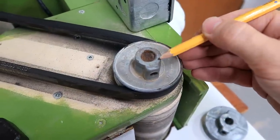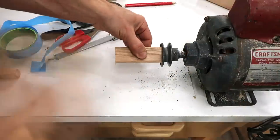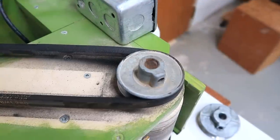Whereas in my workshop, if a pulley starts rattling I notice and I fix it. The pulley in my table saw has started to rattle from time to time, and the pulley in my 20-inch bandsaw also rattled at some point — I just shimmed it. I found that if I take one of these pulleys and put a plastic shim in so tight I have to hammer it on, that doesn't come loose over time.